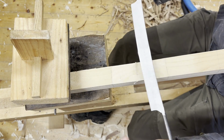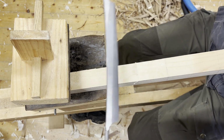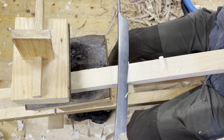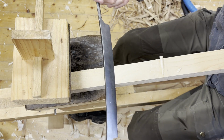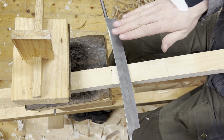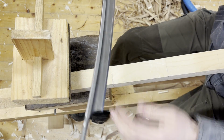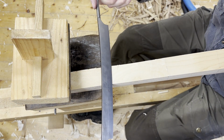Okay, so the flat back prevents a continuous scooping cut. That's where the bevel down comes into play. And this is sharp now. And if you want to have a slight back bevel, a convex one, then you can do slight radiuses or scooping with the bevel up. But yeah, let's see where we have to go here.